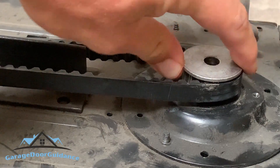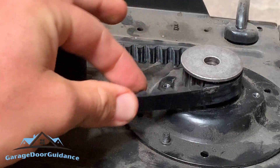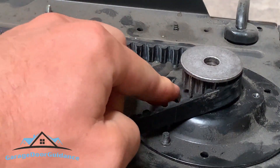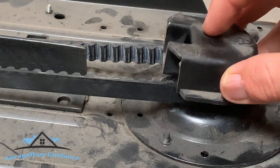We're basically looking to see if this shifts at all — which mine of course doesn't. Then underneath that, if it's a broken gear, we'll see some shavings underneath this sprocket right here. It may not be a good idea to tighten your belt at that point.